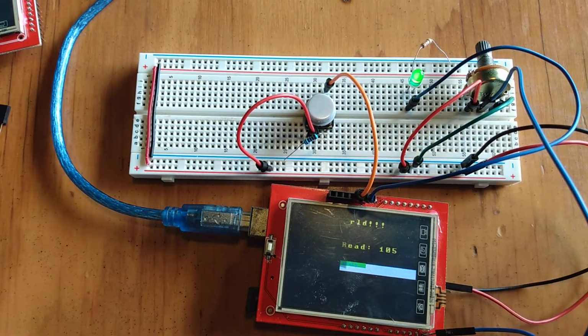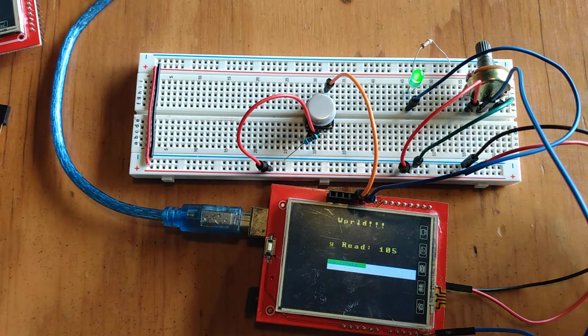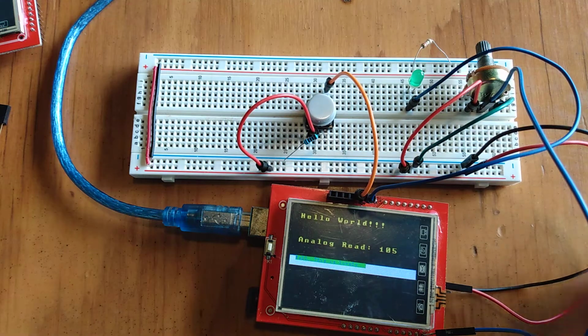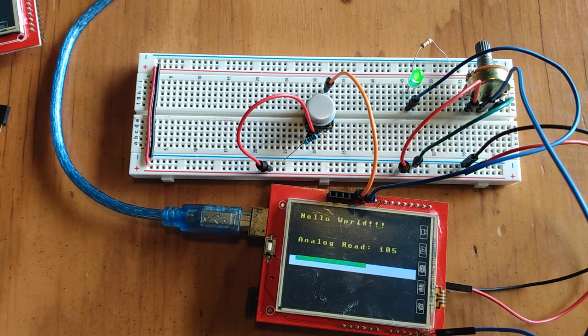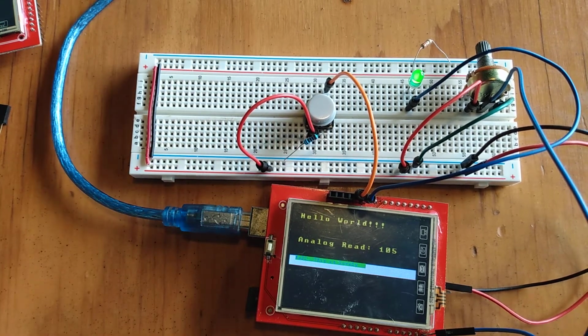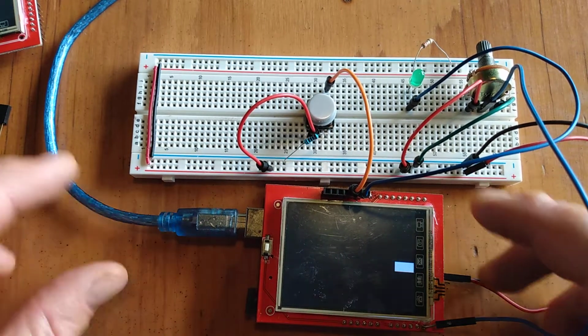So it'll probably take a little bit of configuring integrated circuits or something to get everything worked up, some AND or NOT gates, or some sort of little tricks to get everything lined up with only four pins. But that's four digital outputs and one analog input, which can be another digital output as well, and a really nice modern screen with full color capabilities, and it's a touchscreen. I didn't do any touchscreen stuff in this demo, but much nicer, get some nice output on the projects.